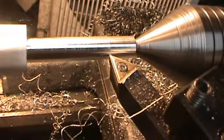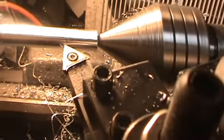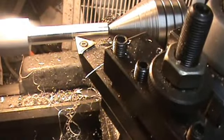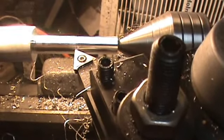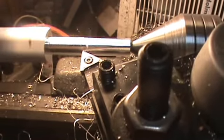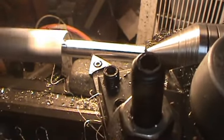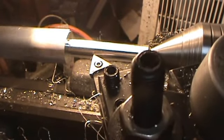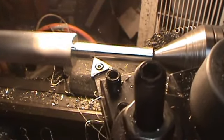Here's the final pass — this should be within a couple thousandths. I'm taking it at the two slow speeds here. There's a lot of fine chips but with this triangular insert that's probably plenty good enough for what I want. It will have a nice shiny appearance. It's not like it's a hard steel machine surface — this will look just fine.